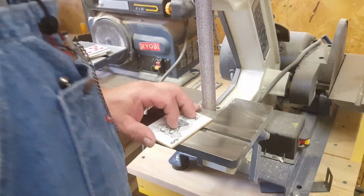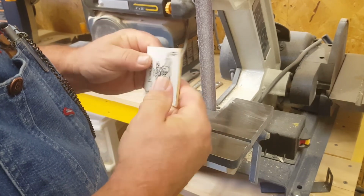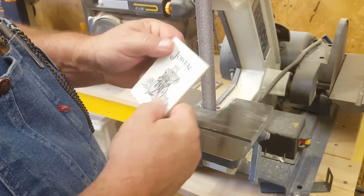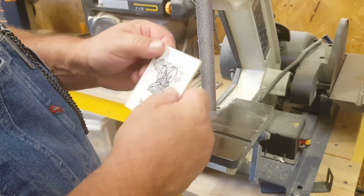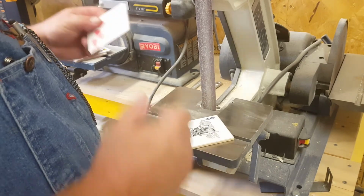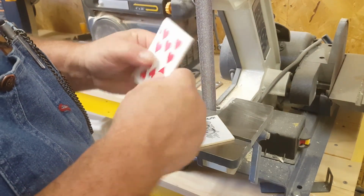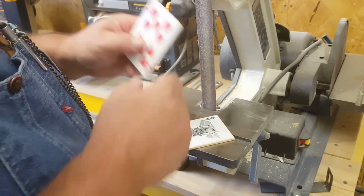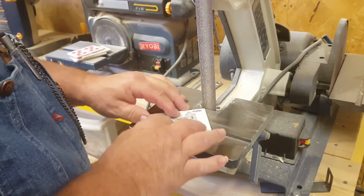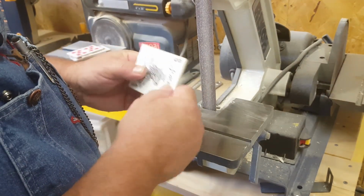Okay, so the card has been dried here for a while. Everything looks good at it. When you cut your blocks of wood, obviously they're going to have square corners off your table saw. But you don't want square cards. A real deck of cards have the rounded corners. You want to make them look like cards as much as possible. So I just use my 1-inch belt sander here to round these edges. Maybe do a little sanding here if I need to make it a little smoother.